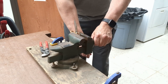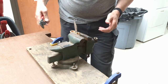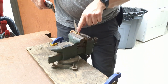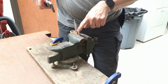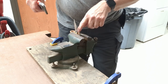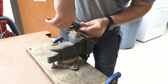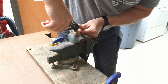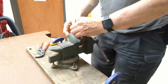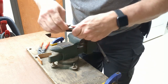One of the things I've learned doing enough knives like this — sometimes you just have to give up. It depends on how hard the steel is, the type of steel, and how they heat treated it. Sometimes it's not heat treated as much down at the base where the pivot is, so there's a little bit of wiggle room to bend it. Sometimes the steel is really hard and feels kind of brittle — like it would break before it would bend. So there's not a hundred percent success rate with doing this.